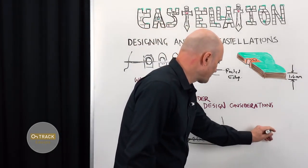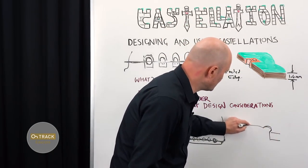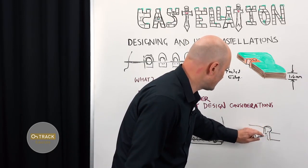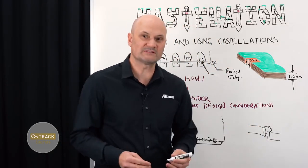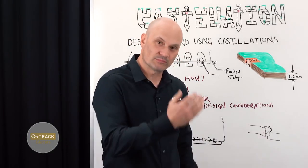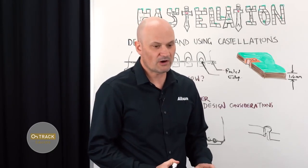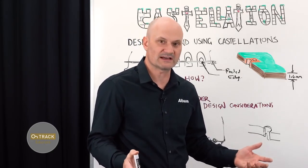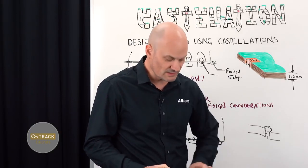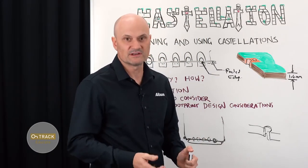You need to specify how clean you want this and talk to the manufacturer about their cleaning processes. They may have a mechanical wire brush to wipe that stuff away. Some prototype manufacturers note on their blogs that cleanup of the board edge is up to you — you may need to manually rub it on some abrasive as an extra assembly step. You must think about this and plan ahead, as it's going to add time and cost to your manufacturing.